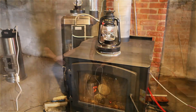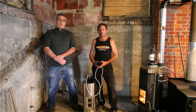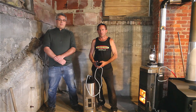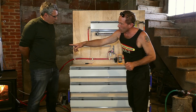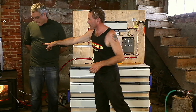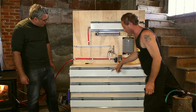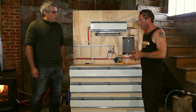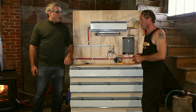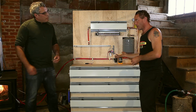Today we're here to show you a self-powered hydronic heating system — a system that will allow you to move heat to various parts of a large or small house using just the heat of your wood stove. So if I'm understanding this correctly, we're heating up water in that device on the side of the stove, and then it comes in through this line in the bottom, and this pump is pushing it through all these heaters, and then it goes back to be reheated. Correct — it's pumping it back to the thermoelectric generator to be reheated, and the byproduct of creating electricity is the hot water.